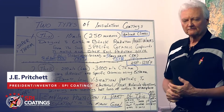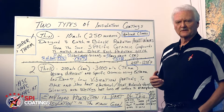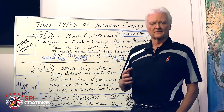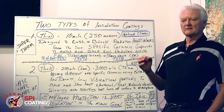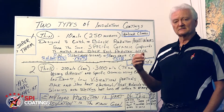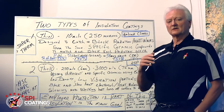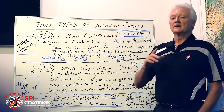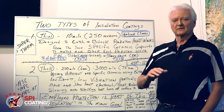In the field of ceramics and ceramic compounds, there's the thought that maybe hollow spheres alone are all you'd need for insulation. But over the 34 years I've studied ceramic compounds, it became clear that ceramic compounds come in certain sizes, and a particular micron size will block a wave while another will not. A hollow sphere can help, but it's not going to do everything by itself because a hollow sphere can also load heat over time and it'll start to drift through the coating film.